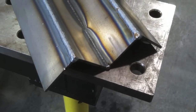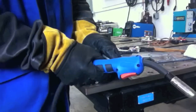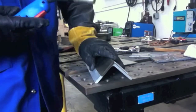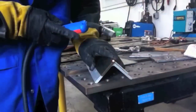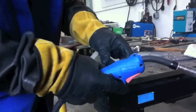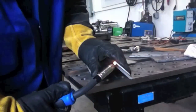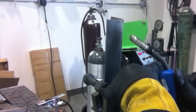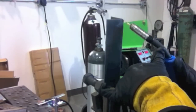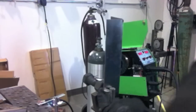Before we get to the dice, let's just talk about doing normal 2 inch by 8 inch joints like you would do in welding school. We're going to tack a couple of them up first — set one up and do it vertical downhill, then lay one on the bench and do it flat. It really speeds things up if you have a piece of scrap angle iron to hold them with one hand, or you can use pony clamps, rather than just trying to hold them up like a teepee and having them fall all over the place while you try to tack them.